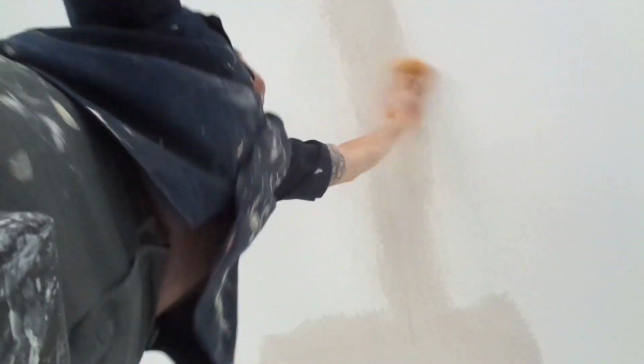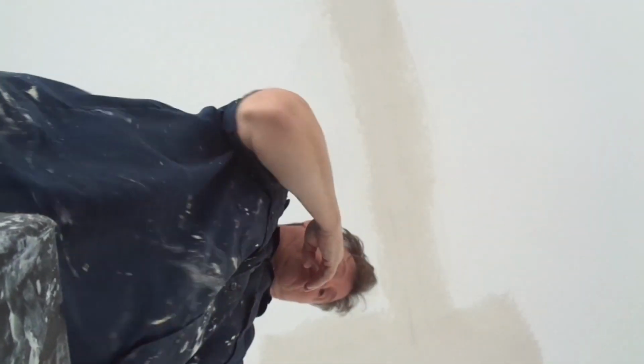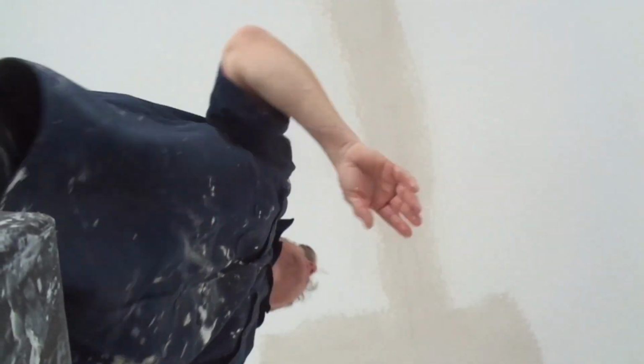Maybe you're not too comfortable doing the texture matching, but you can do up to this process and maybe just hire someone to texture, and just leave it smooth. At least it's sealed up. Nice feathered out edge, so the texture will blend in nicely. Otherwise it'll have a sharp mud edge there. You don't want to see that sharp mud edge when you go to paint.